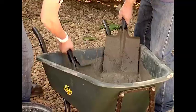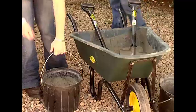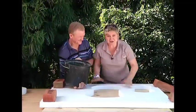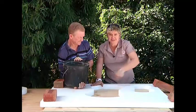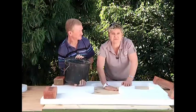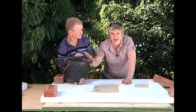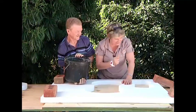Just to recap: we had the big piece of polystyrene, made a figure of eight, and used a jigsaw to cut that out. We've now put a level board underneath it, which is going to be our main platform — because remember we always need something level underneath to create the paver. We've now done our mixture: one stone, one cement and two parts of sand. And now, let's do it.